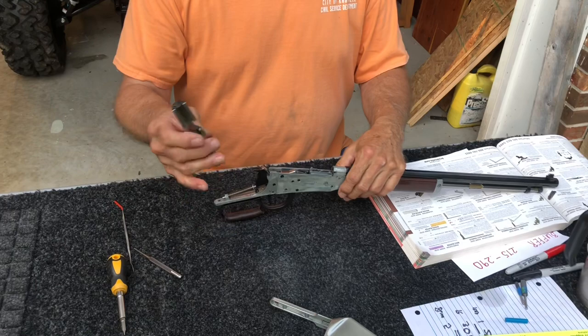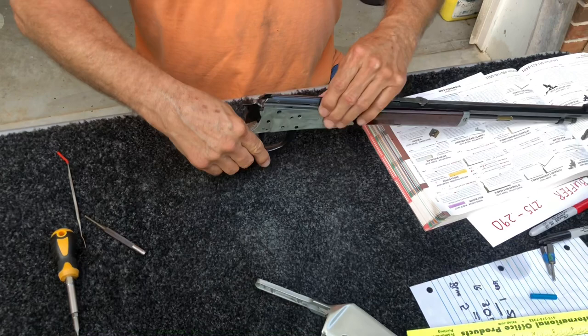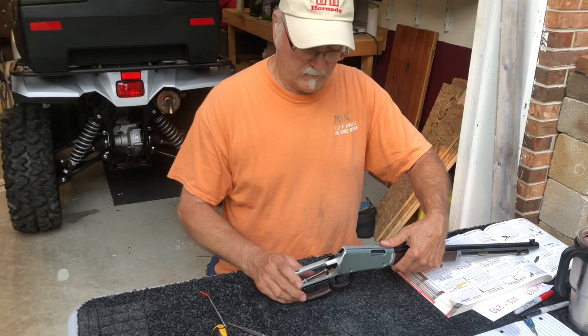Now the bolt. After you trim up the sides of the bolt and have the bolt width 0.782 front to back, putting it back together: cock your lever halfway open, set the bolt on the lever in the groove, close it. Leave hammer cocked and slide your hood back on.